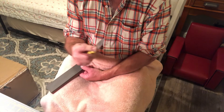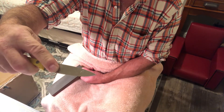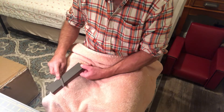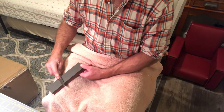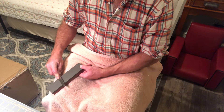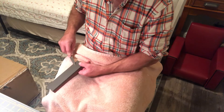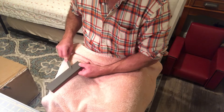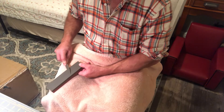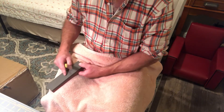So trying to keep the same angle is extremely difficult. I have you put your first finger on the blade and kind of press that down with your finger. Bring it back to the stone. Get your angle at least an eighth of an inch off the stone. Then lock your wrist, bring the blade back to the beginning, and take a bow to see if the knife moves. The farther away your hand gets from your body, the harder it is to push, and this is abrasive.